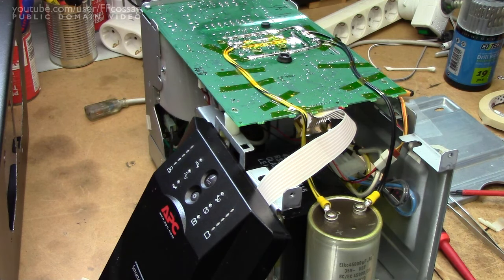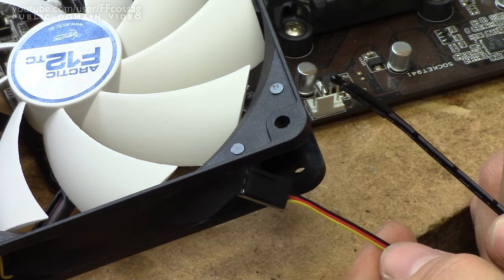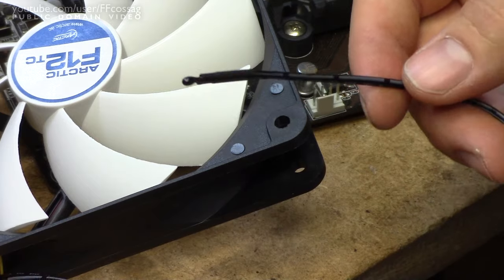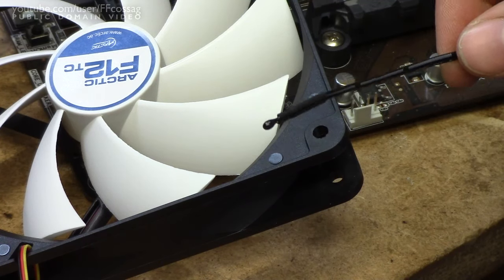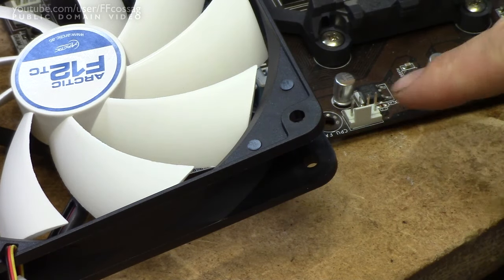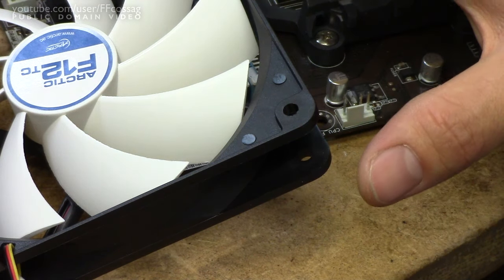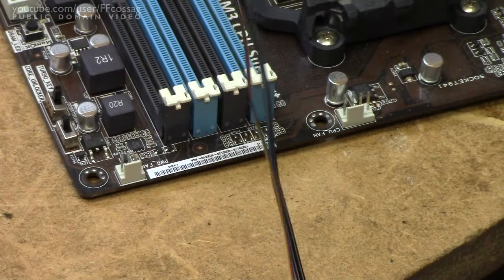All I've got to do is mount it back together and see if it runs. But before I mount it, I'm going to have to do something about this temperature sensor for these fans, because as you can see it's attached permanently to the fan with a wire. I would have to remove this every time I take off the case, and I want to be able to just disconnect everything. So I'm going to add a connector to it. My solution is pretty simple — I'm just going to snag a couple of 4-pin fan connectors off random fans and a couple off this old motherboard. I don't need the tachometer signal, so I basically just need the 2 pins for power and the 2 pins for the NTC. That'll work out just fine.